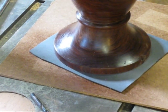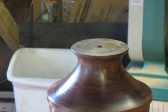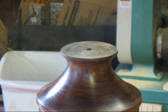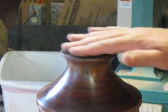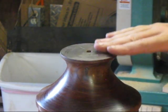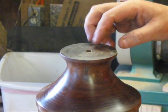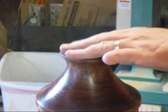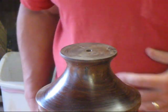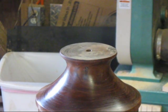I went ahead and cut the tenon off the top with my bandsaw, then took it to my belt sander and sanded it. Then I put a good heavy coat of thin CA glue over the whole thing - it's all ingrained - just to seal that up really good. Then I came back with a couple coats of wax. That should be really good to go. As soon as this sets up, I'll trim that off and then start assembling this thing.